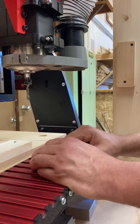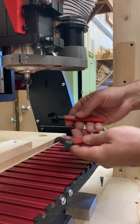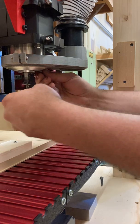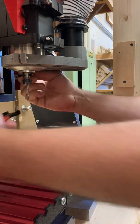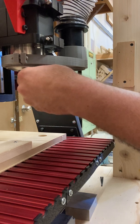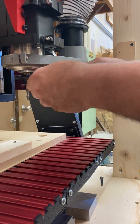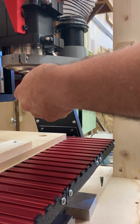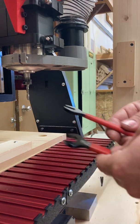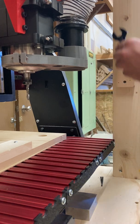I'm going to put it right about there, and then just watch it to make sure it doesn't drop out as I'm tightening the collet. I use the same two wrenches, and it's basically a reverse technique — instead of pushing the wrenches away from each other, I'm going to push them towards each other. One important thing is to not make it too tight. These wrenches are short on purpose. I don't want to over-tighten and risk breaking these parts or cross-threading. What I'm looking for is a tight tension where I have to put a little bit of muscle into it, but I don't want to be He-Man or Mr. Gladiator, because that's going to wear out parts prematurely, break things, and nobody wants that.